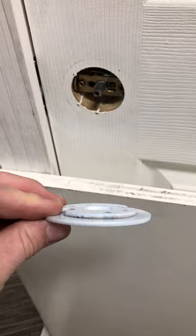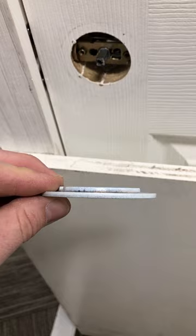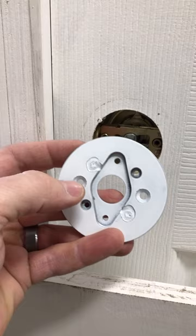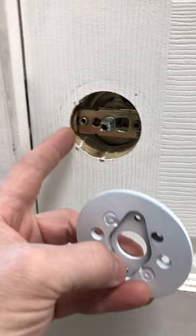You can see there are two diameter discs of eighth-inch steel here. The smaller diameter is going to go on the inside, and then this diamond-shaped cutout is going to go up and down. The two countersunk holes on the sides are going to hold the handle from the other side using number eight countersunk screws. I'm going to do that right now.